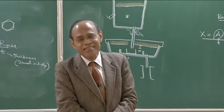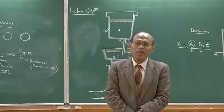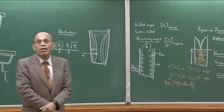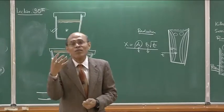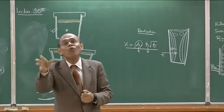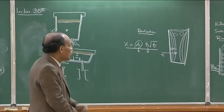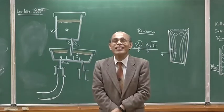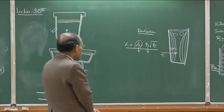You would require many overhead cranes and a huge program for maintenance of these ingots. Most importantly, 10-ton ingots will require significant subsequent rolling and forging — because steels are not going to be used in the form of ingots — and that is an intensely energy-demanding process. So there has been an increasing tendency to circumvent all these problems with a process that has a high turnover rate, matching the BOF and blast furnace hot metal production.